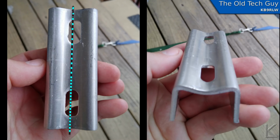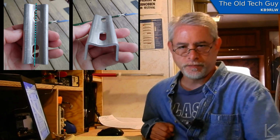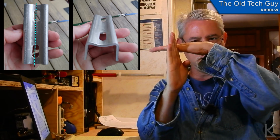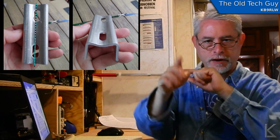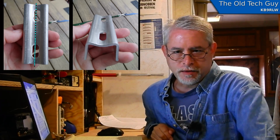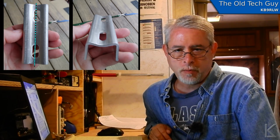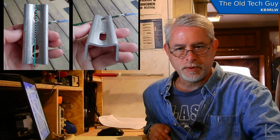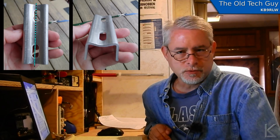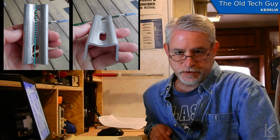And when he got the beam together there on the ground and he looked at it, the director was not 90 degrees to the boom. Instead of being nice and straight, it was tilted. And from the ends of the director to the driven element, in fact, there was a disparity between the two sides of about 8 to 12 inches, almost a foot, he said. And he flipped it around. He flipped the piece around to make sure he wasn't seeing things or had put it together wrong. And sure enough, it was skewing the other direction. So that was the first problem he had.